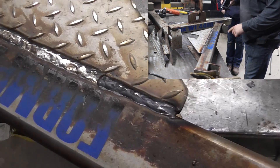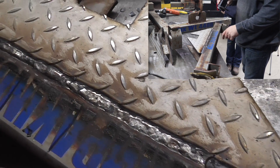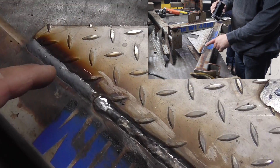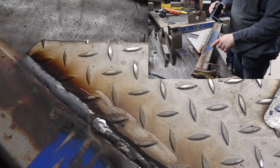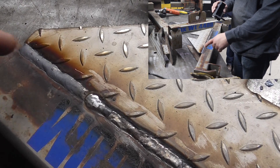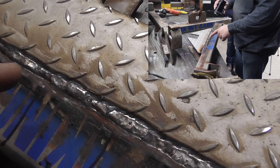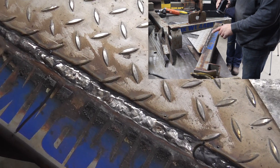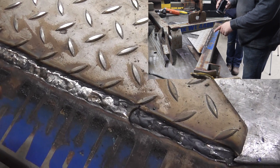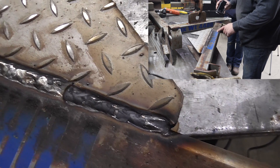Let's talk about this a little bit. The slag here is still on — it's cooling down and it just popped right off. This is the pulse welded part. You see, after your torch moves, you lose your shielding gas coverage, ambient air rushes in and discolors your weld. Here, where the slag blanket lets it cool down slow and keeps the atmosphere out, it's a nice and shiny weld. The toes are wet and perfect, the stuff goes down totally without any spatter.